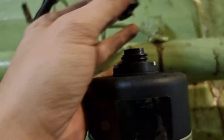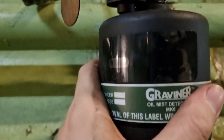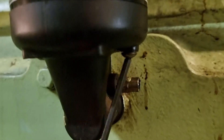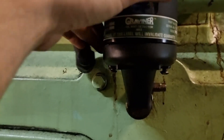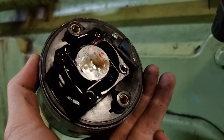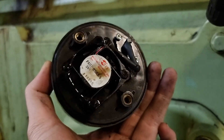The indicating green light will be off, and we can use the allen key to remove the detector head. We need to put extra care in lifting the detector head as we might damage the small fan inside. I'm going to show you how to dismantle this small fan and clean it later.